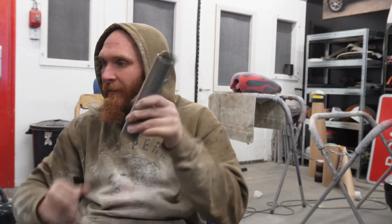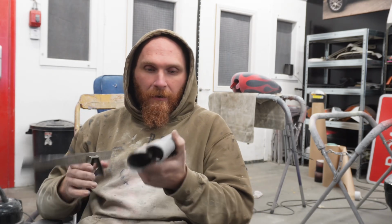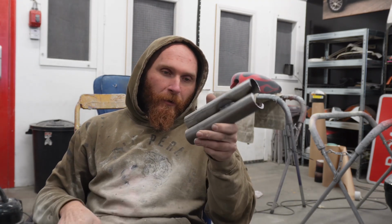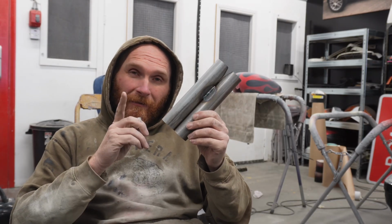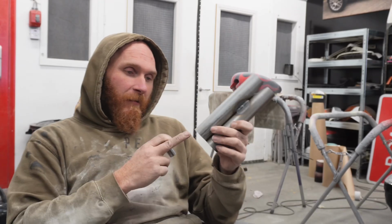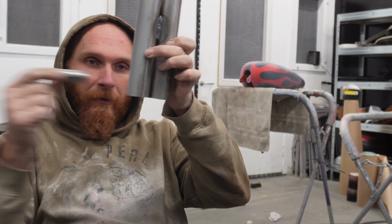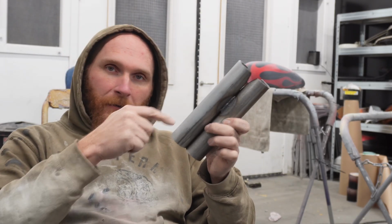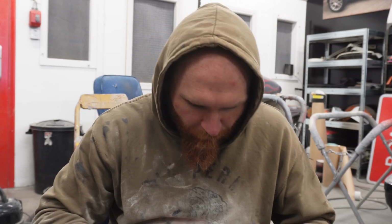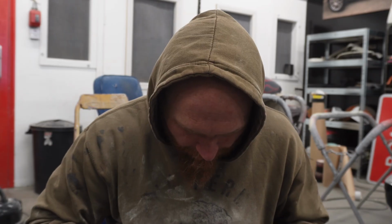So now that I've got my length of my second steering tube extension, I thought I'll mark out where I've got to drill a hole in the bottom of it, because the pipe that I'm going to put at the bottom of this for the swing arm pivot, rather than notch that out, I think it'd be better to drill a hole and slide that tube in. It can't go anywhere then, and then we'll weld it around each side. I'm not going to drill the hole until I've got the pipe, because knowing my luck, I'll get a different outer diameter, or I'd have drilled the wrong hole then.